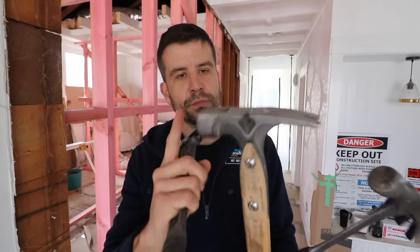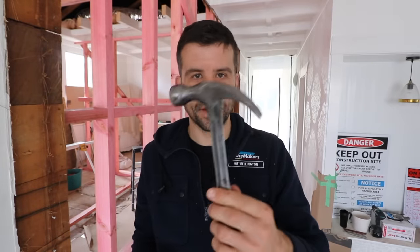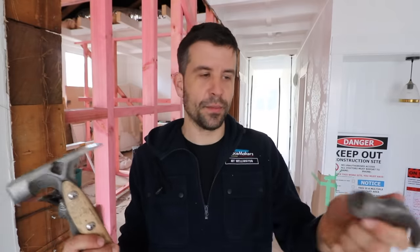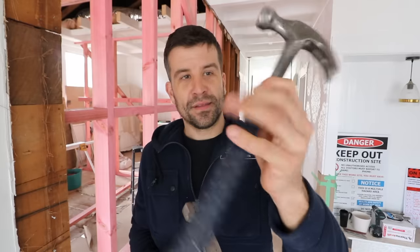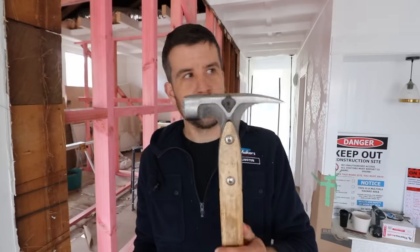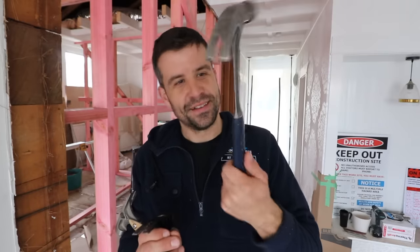This is the Vaughn that I've been talking about. This was my first hammer. It's actually Pardo's, but I had the exact same one. And I think the main thing to consider, if you don't know much about titanium hammers and steel hammers, is it's a weight thing, but it's also a vibration thing. The steel that runs all the way through this hammer, through the rubber here, that leads to a lot of vibration going to your elbow, to your joints, to your wrist. It's a lump of steel there. It's a lump of steel, exactly. It's a lump of steel, essentially, all the way down.